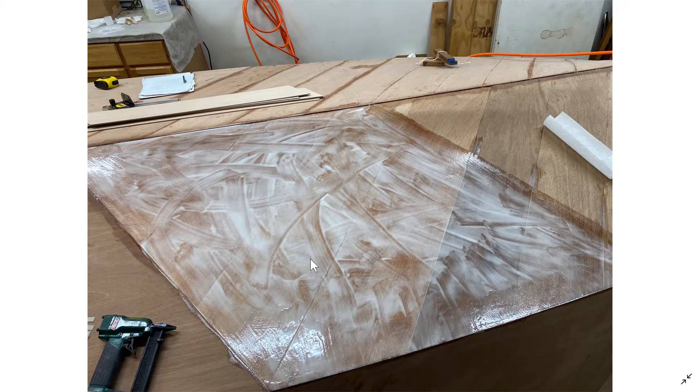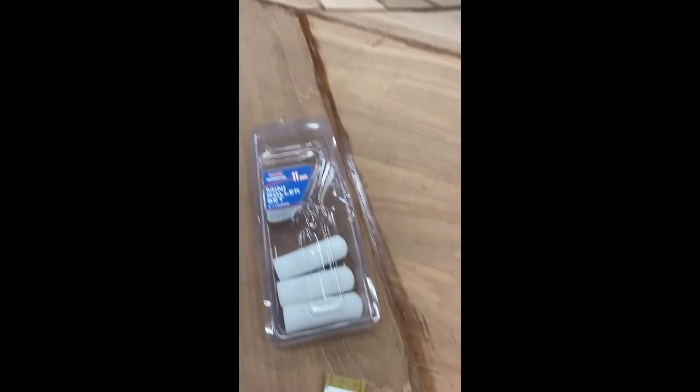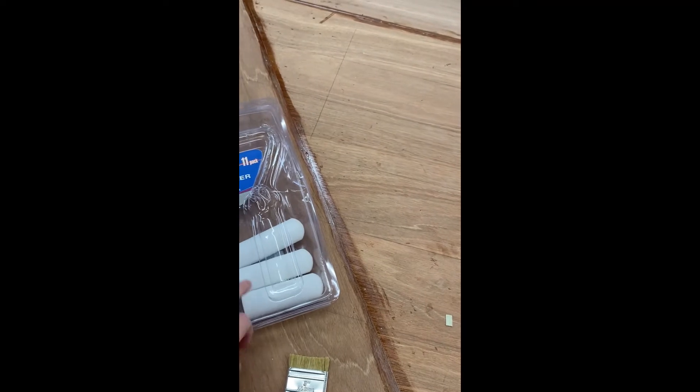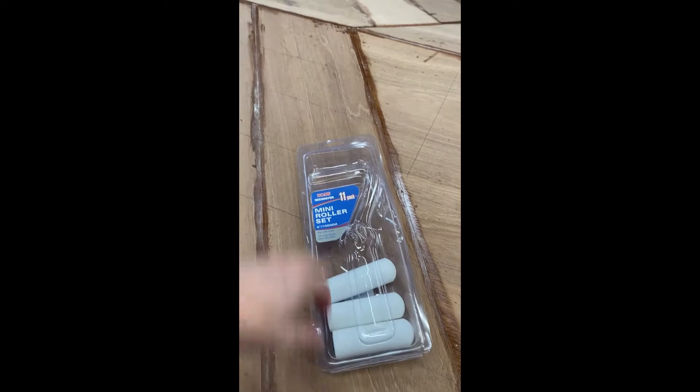Here's that picture showing how I've got the thickened epoxy placed on the boat ready for the planking pieces, and then here are the planking pieces after they've been attached. Also, when I encapsulate I use these four-inch foam rollers to do the encapsulating with the thinner epoxy.